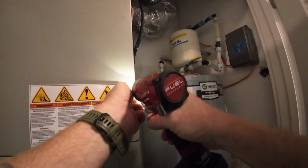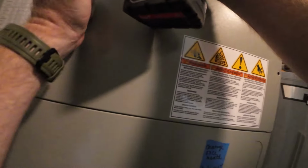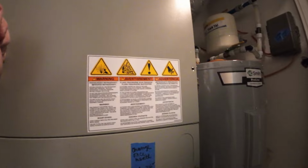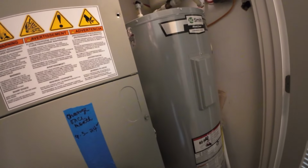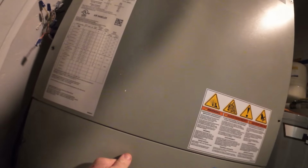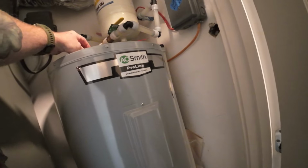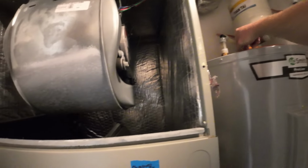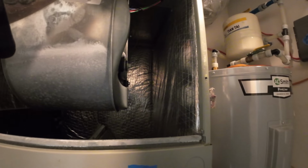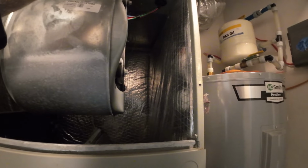We're still getting 54-degree temp coming out. So just for sure, cooling right now. So the issue could be here, the issue could be upstairs on the roof. There's wire nuts just sitting here. We got yellow right here with no wire nut on it. That's because these wire nuts, somebody else has looked at this thing.